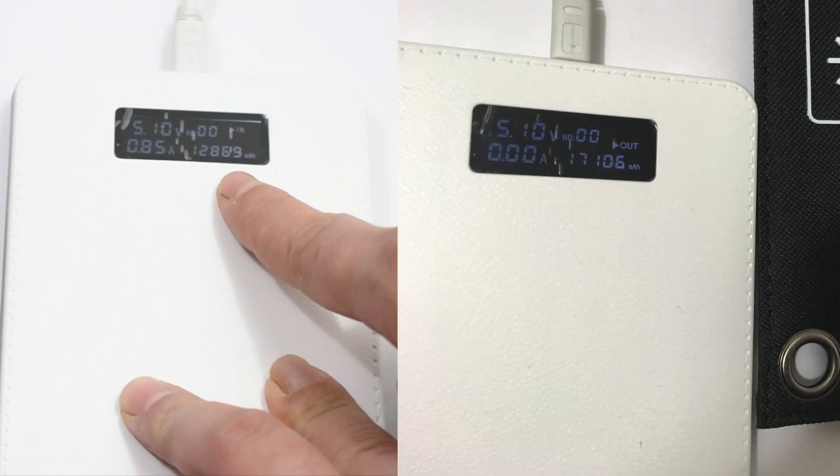Five hours later I only had three bars on the solar panel out of four, but the solar panel had charged my other battery by 4,237 milliamps. Like I suspected, it's probably around a 6,000 milliamp-hour battery inside. This is not a scientific test, but I am very close to the actual milliamp-hour rating. This will definitely work for my upcoming Raspberry Pi project without a doubt. At roughly 6,000 milliamp hours, it's going to take around 22 to 23 hours of full sunlight to completely charge this up.